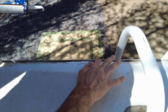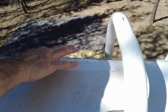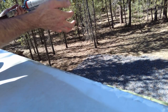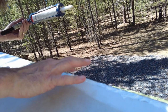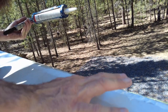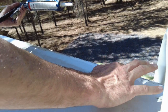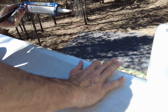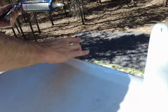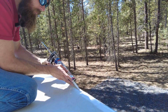With the lay-flat sealant I like to do a circular motion, but it's really important you do this while it's still very fresh. It'll smooth out all those weird spots, and the point is to get it in all the crevices and create a really good seal. Once you feel it's in all the crevices, run your finger over it to make it nice and flat, and repeat that process. You can go right over the old caulking as long as it's not flaking off.